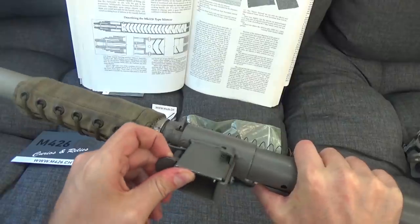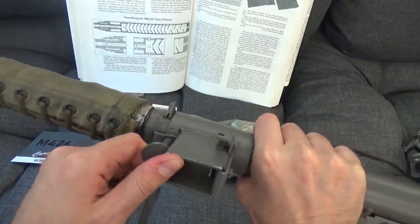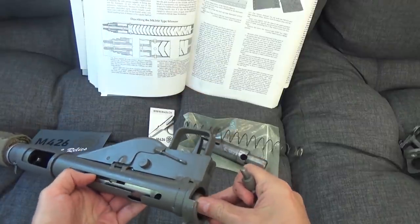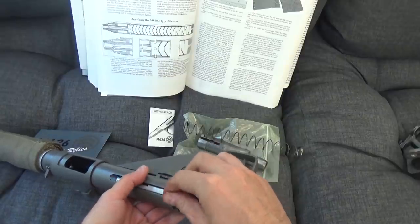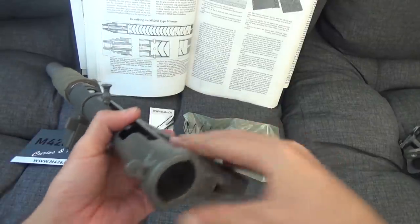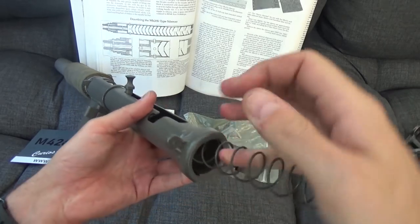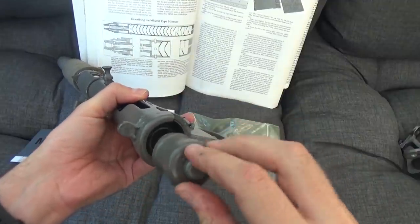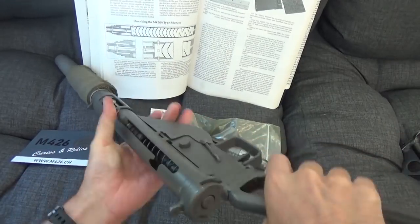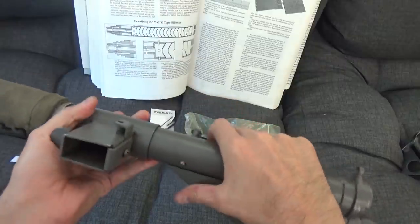If we put it back together fully — there's a ratchet in there that the little catch, held in with a powerful spring on the magazine housing, interacts with, and you can tighten that down. Breech block goes in like that — you need to pull the trigger to let it forward. Once we've found the hole, put it in, run it forward — never just drop one in, you can damage the ejector. The spring has the collar there to interact properly, so that goes in that end first. End cup like that. And there we go.